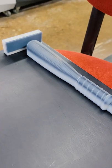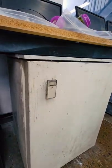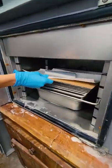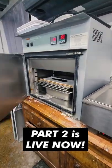This is super slowed down, and four hours later it was done, but it was covered in wax so it needs to be post-processed. First it gets put into a freezer for a couple minutes — this will allow it to break free from the build plate without any damage to the piece. Next it gets put into an oven for all the exterior wax to get melted off. It went in gray and it comes out completely black.